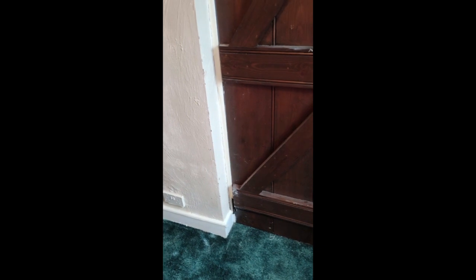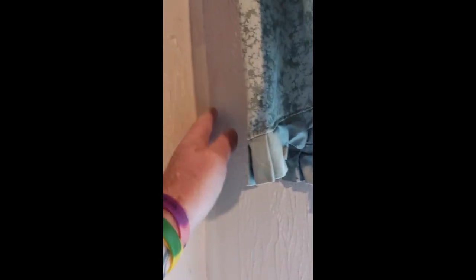We've done the beam at the top. The stone supports have come out because this bit of the building is an extension. So we've got everything masked off and we're all ready to go. Normally you wouldn't have to mask off the wall up to where you're painting, but because this wall is the only one going to be this colour, you've had to mask off the walls on each side as well.